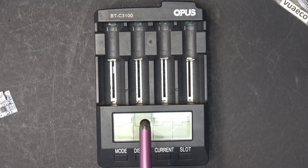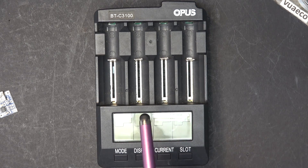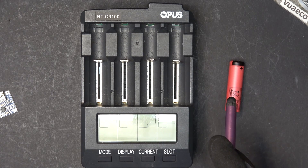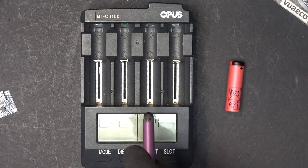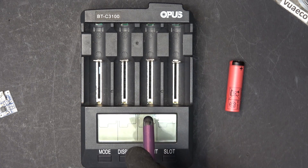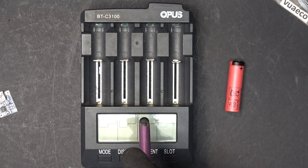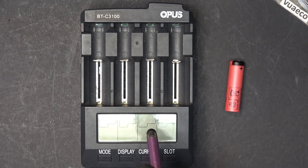This is the charger I've been using for the 14500. It's a very good charger and you can adjust the current down to 200 milliamp, which is perfect for this battery because its capacity is only 740 milliamp hour. So you should only charge it at between 200 to 300 milliamp max. The problem with this charger is it can only charge four at a time, but the biggest problem is it's getting quite expensive. When I bought this a few years ago it was only 25 dollars, now it's 50 dollars — only about two to three years ago and the price has doubled.